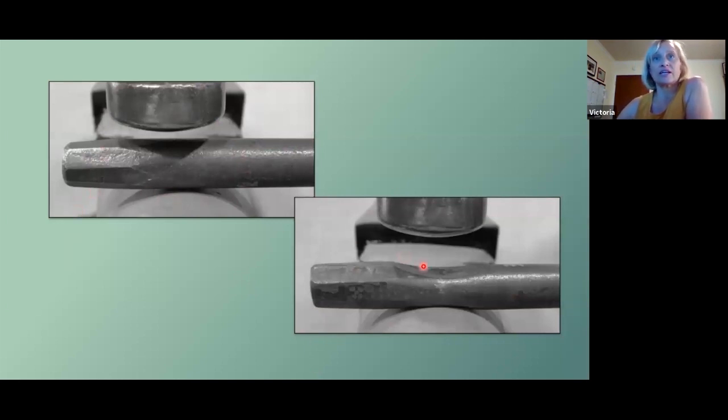And the indexing is something you're going to hold on to, meaning you wanted a particular direction. And the placement of that is going to end up strategic. The only thing I would have you be concerned about at this point is keep it so that there's a flat up and a flat down. You've got 8 choices, so pick one of them. If you don't have the flat up and the flat down, when you go to straighten this tool out, you could end up dinging one of your pretty little octagons. So that helps you straighten your tool by being able to hit it on a flat edge.